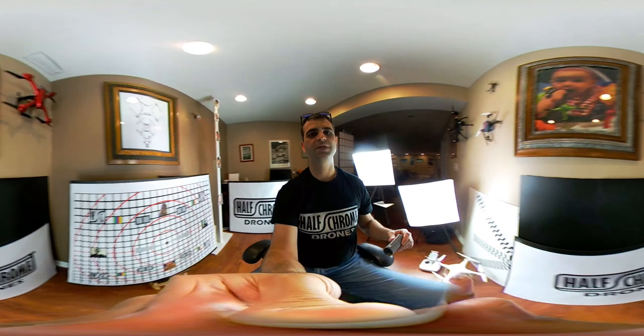Okay, now that's interesting. How about yaw? You'll see the world spinning — get a nice tour of the lab there. So, a little bit different. What you basically have here is two-axis image stabilization done electronically. Now, we would love to see it be able to get rid of some of these more jittery effects — hope I'm not making you nauseous — but for now we're happy with what it has. We'd like to see them upgrade the software a little bit more. Obviously, it has the gyros and accelerometers on there to do it. So, you've seen some of the features. Let's go fly some more.